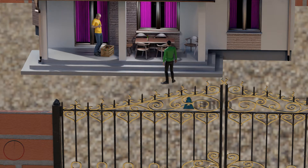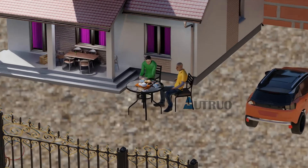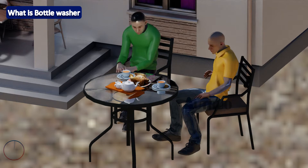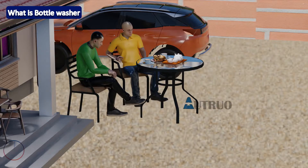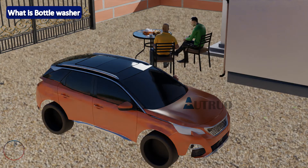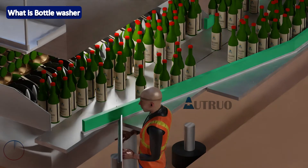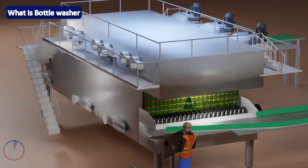Because there is a lot of things that come into play here. Those bottles you saw earlier are called RGB, which means Returnable Glass Bottles. These bottles are retrieved after usage. Certain conditions must be met — they must not be weathered, broken, cracked, or chipped. The retrieved bottles will be loaded into the machine, which is called a bottle washer.